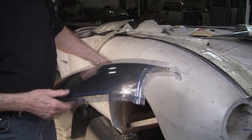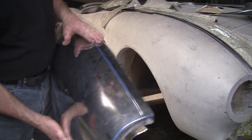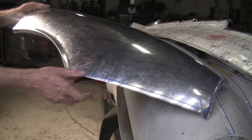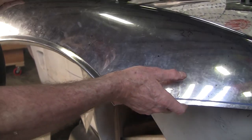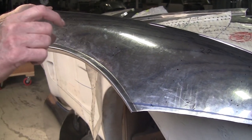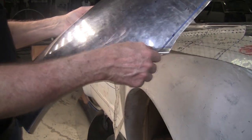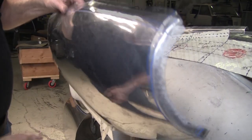I teach how to do really nice surface quality so the panel is as flawless as possible. There are secondary operations: tipping this flange for the headlight mount point, and this peak right here has been tipped. The wheel opening arch is all done with the tipping wheel. A lot of people say they could do that on a pull max, but the problem is the pull max has parallel dies and this isn't parallel — with the tipping wheel you have the freedom of making a non-parallel enhancement.